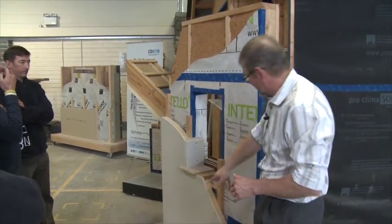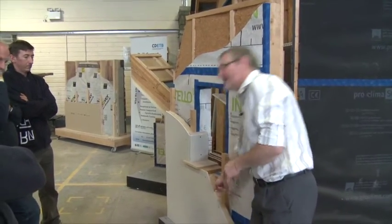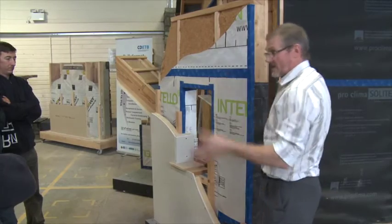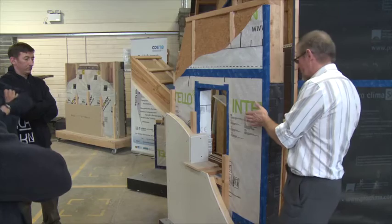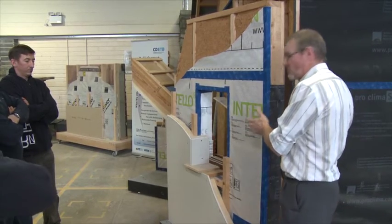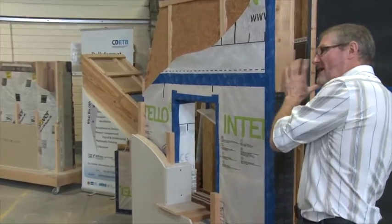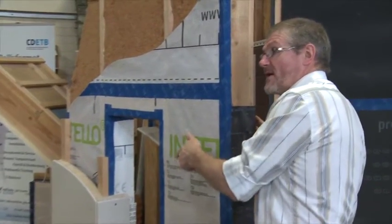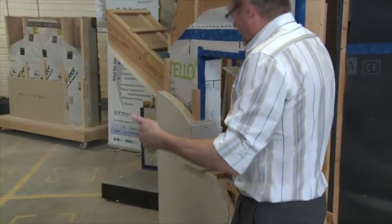On the inside of that, they've introduced a warm board. Now if I add this insulation, my U-value is meeting the building regulations requirements — actually probably about 0.18 on this overall construction. We nearly have 200 millimetres of insulation, three different types: two with an okay U-value and one with a much better U-value in terms of the overall.